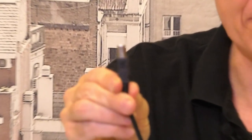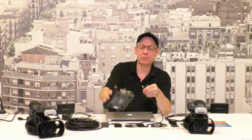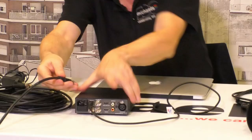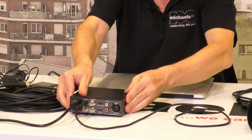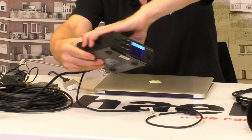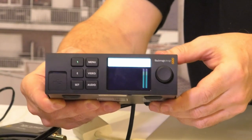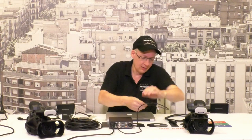The Web Presenter connects to the laptop through a standard USB - the square format, Type-B connector that your old printer used to use. Everybody's got one of these cables, and of course the cable is provided when you hire. There's no power switch on the Web Presenter - when you apply power it just turns on. From the front panel there's a small display, a simple control knob, and a few buttons to choose your menu settings and switch between camera one and camera two.